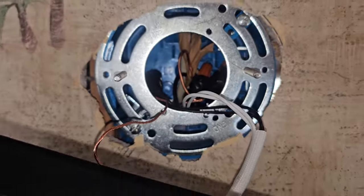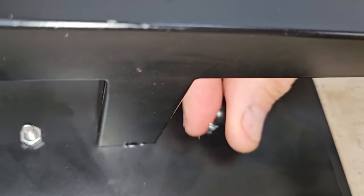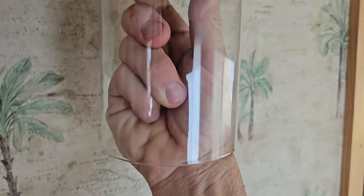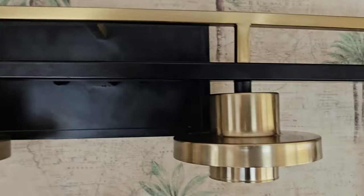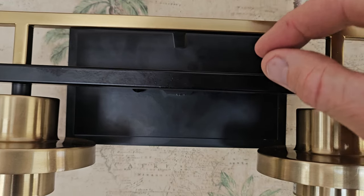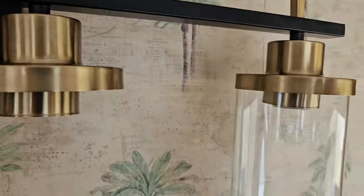My little nuts are removed as well so it slips on. Then your washers go on the outside of the light fixture right here — tighten those down. That's a seven millimeter wrench or socket. Then your little black covers go over the top here. Remove that gold cover first, then slip on your glass. I have pretty large hands and it was a little tight in there, but if you have a small child that you can put up on a ladder carefully, that might be the better option. Also wait for a helper — it's pretty inconvenient trying to hold this up on a step stool or ladder with one hand while trying to get your wires twisted together with lineman's pliers and electrical tape with one hand. It'd be a lot easier if someone held it up so you could work with both hands. It is one-man optional, but definitely better with two.